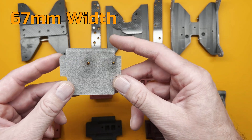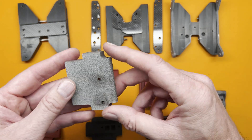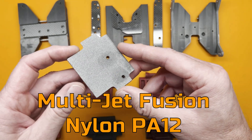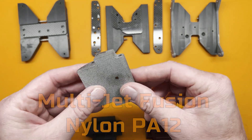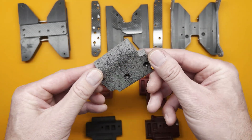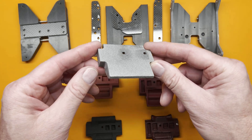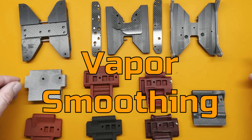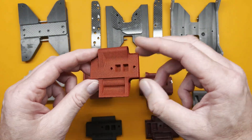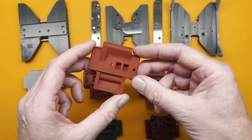This was a 67 millimeter skid. This material is nylon PA12, made from Multi Jet Fusion, or MJF, 3D printing technology. It's really high quality, and this is kind of the raw look — it just has this gray finish, it's black underneath. This is what I do for the first pass, and then if I like it, I'll go on to a better surface finish. After I liked that first geometry, I went back and added some pockets, streamlined things, made things a lot smoother, and this is the one I ran for a while.